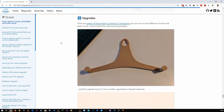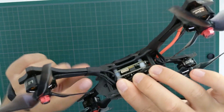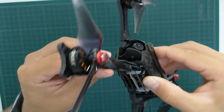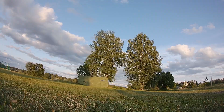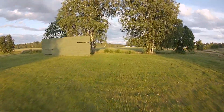If you have a 3D printer, you should definitely check out the EMAX Hawk 5 projects on Thingiverse — there are a bunch of different wall mounts and pagoda antenna mounts. One thing that is very easy to do and I definitely recommend is to wrap some electrical tape around the shrink tubes on the arms, because those tend to get loose a little bit and the props could actually snap your motor wires. And here is some sample footage shot with the Runcam 5.